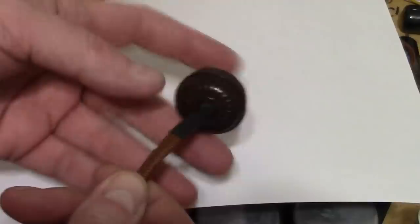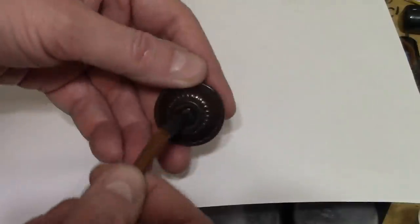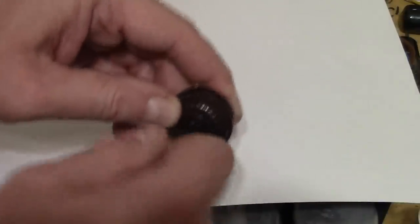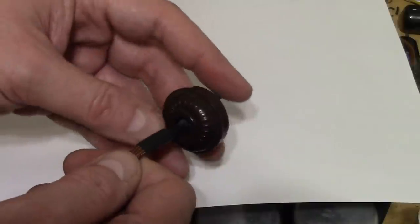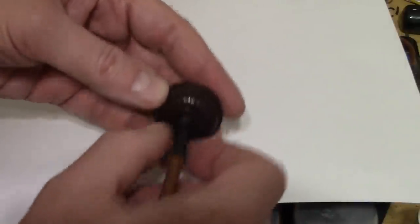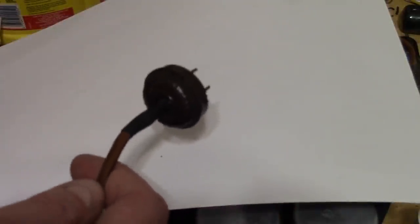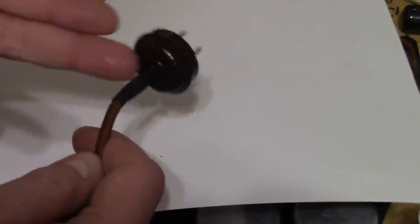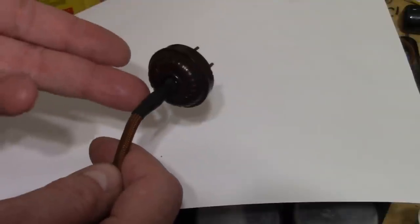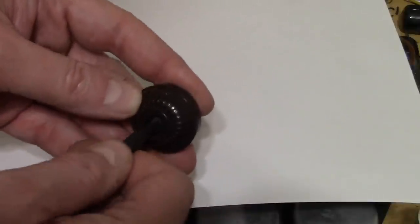But what I don't get about these vintage plugs is whenever I've come across them, it's just been the two conductor wire going right through this hard Bakelite shell and out of the screw terminals, and that's it. And the two wires are just flopping around in there. It seems to me that eventually they're going to fray and break because there's no rubber boot on there to provide some cushioning. So typically I'll put a couple layers of heat shrink tubing of increasing diameter just to give it something, but even so, it's not that great.